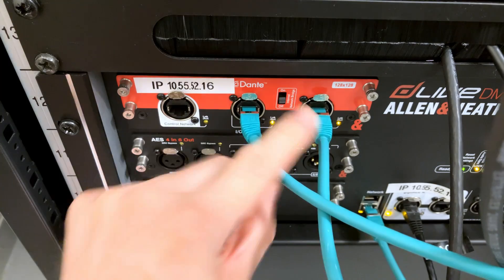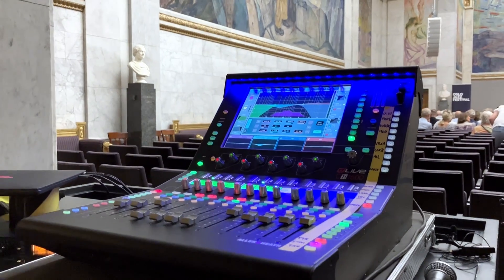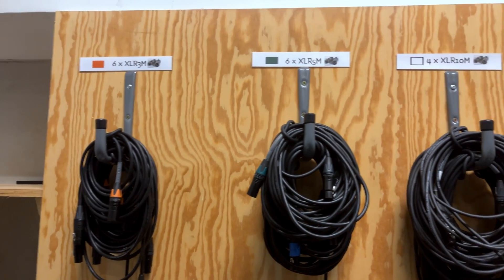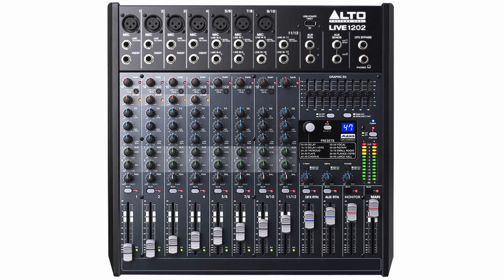We need to know a little bit about digital signals. When you plug a microphone into the stagebox, turn up the gain, and convert it to digital, the digital stagebox is an extension of the mixer itself — almost as if you plugged straight into the mixer. This digitization turns the signal into ones and zeros which the mixer can understand. If you have an analog mixer, it does not understand ones and zeros — it only understands varying voltages, analog signals. Sending ones and zeros into an analog mixer would just produce noise with no musical content. Even some digital mixers, like the QSC TouchMix, don't actually have digital input and output, so you cannot add a digital stagebox to extend them.